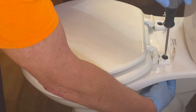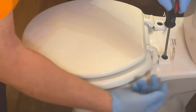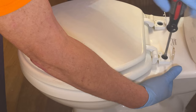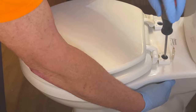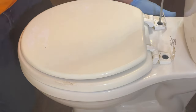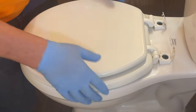Just do that until the nut's off. Now these nuts have a little wing on them — some might have two wings. What that is, when you tighten them down, those wings will go up in there and hit the side of the toilet underneath, so you don't have to hold them or use any kind of socket. I'll go ahead and remove these. There you go. Then you can just lift it straight off.